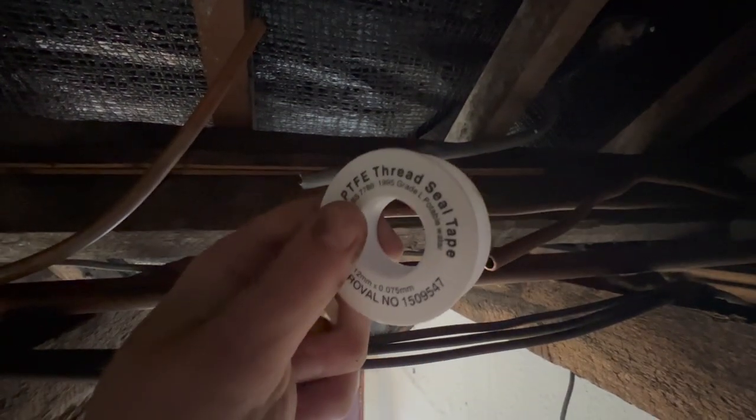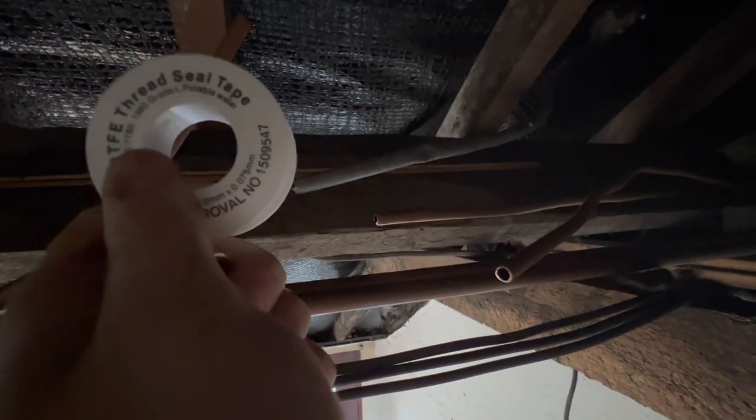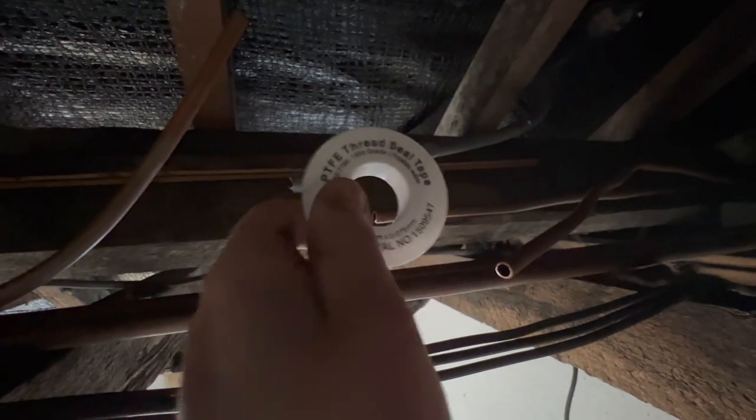Okay, so I got my two ends cut there and there. It's hard to see over the camera. I'm going to use some PTFE now on the threads of the tops of my stop ends. Put some PTFE around the olive as well. And then we're going to get it nice and tightened up and clamped on. Fill the system back up. Probably big air pockets in this area, so it shouldn't get any leaks, hopefully. And then we go from there.